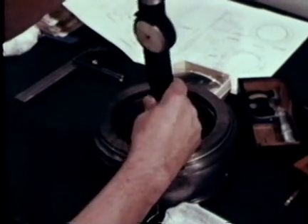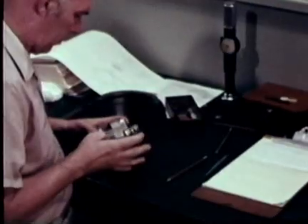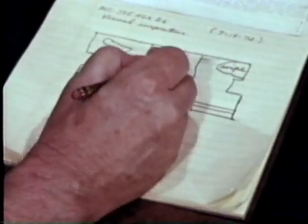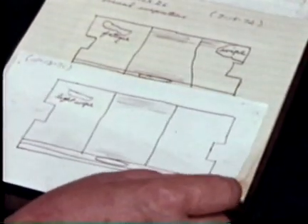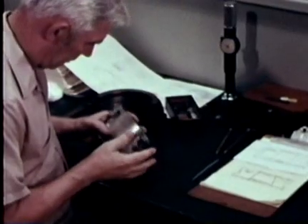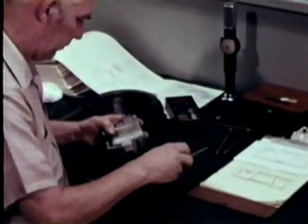Comparators provide the most accurate method for obtaining these measurements. Carefully inspect each piece for signs of damage. Sketch the damage you find and keep those sketches. Make complete, accurate records of all your visual inspections. In the future, they'll prove invaluable for evaluating changes in the condition of the bearing. Progressive changes often give valuable information that can't be gained from a one-time inspection. Now that we've seen how to record what we find, we'll look closely at a variety of failure modes commonly occurring on plain bearings, using our case study self-aligning precision bearing.